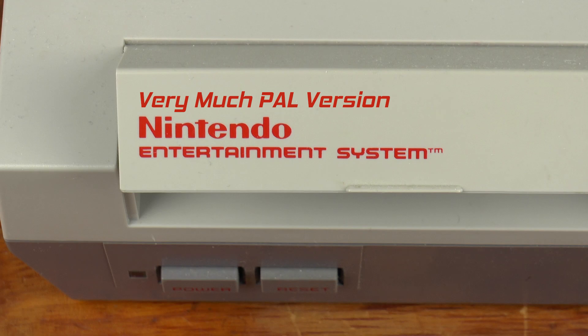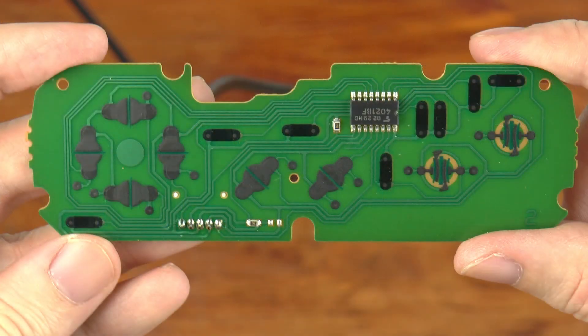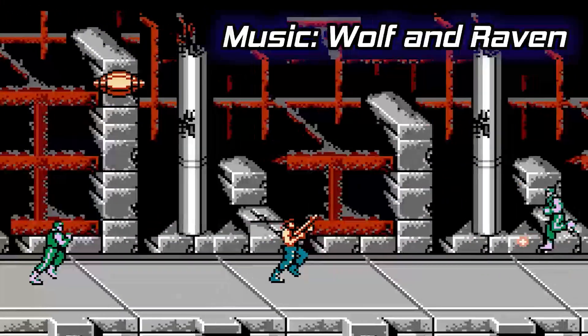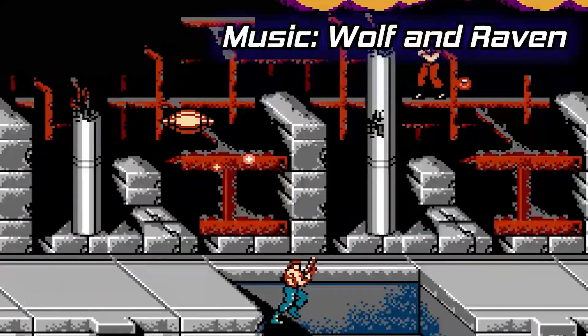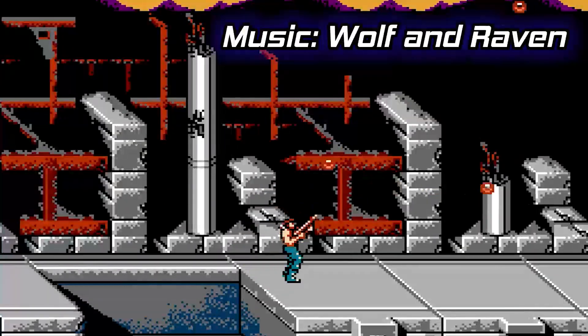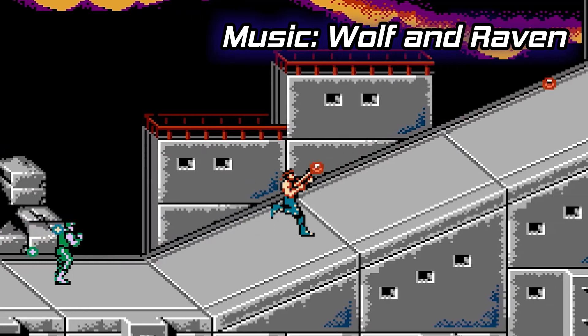There is a much larger story on controller compatibility for various international consoles, especially in Europe, but I do not own any of those consoles. A second Dogbone controller, HVC 102, has a PCB with a later date — September 1993 — and used a smaller chip for the shift register. I imagine we could go even further with controllers, but I think that is enough for this video. I hope you enjoyed this examination of the electronics of the standard controller for the Nintendo Entertainment System. I value your feedback, and would love a thumbs up if you enjoy content like this. Thanks for watching.